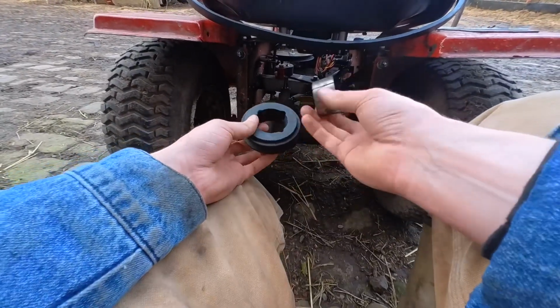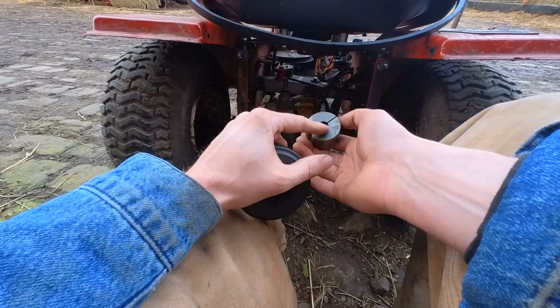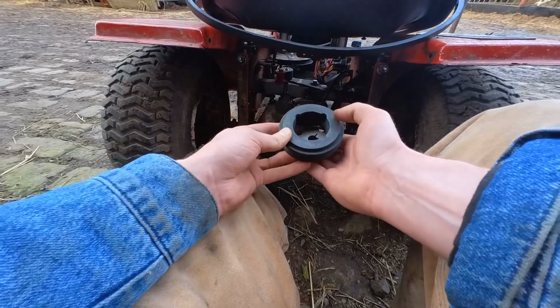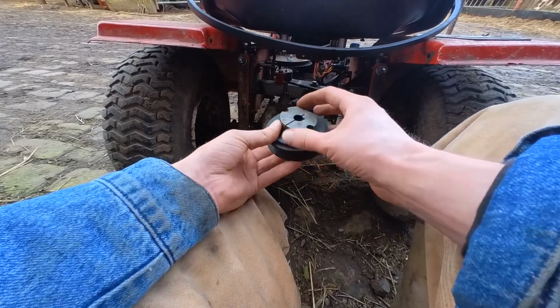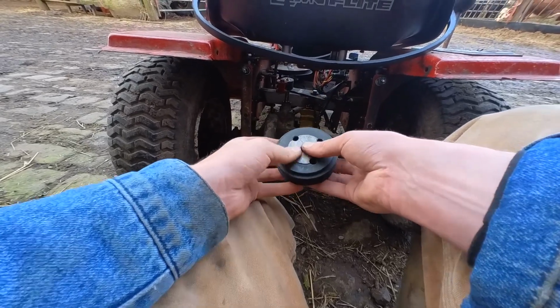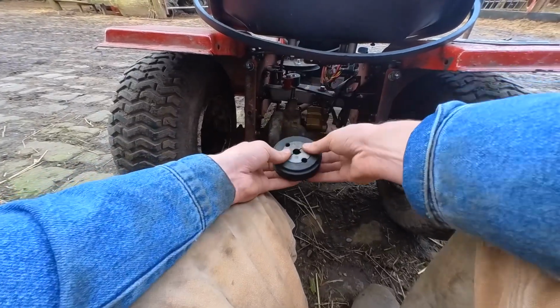Now, what that means is I can order the inside shaft size as I want, and then I can get different size outers, and you put that in. Interesting that you kind of have to put it all on together. Anyway, I've got a Woodruff key to go in there, and then you put your grub screws in and it locks it onto the thing.